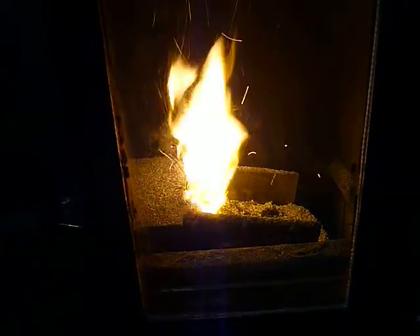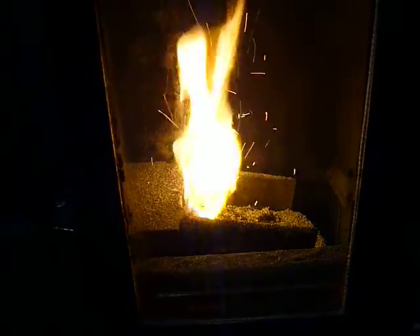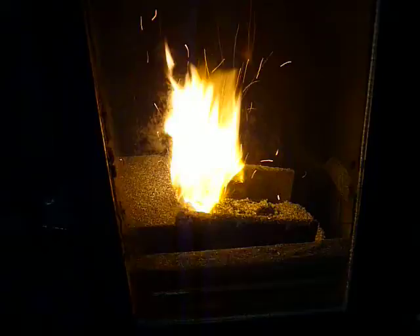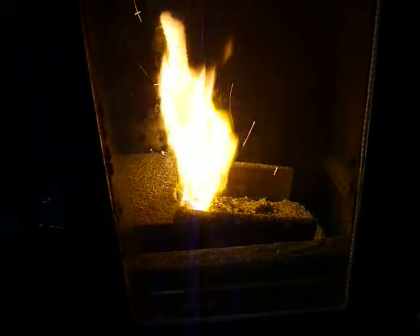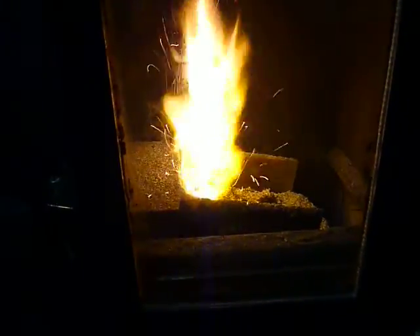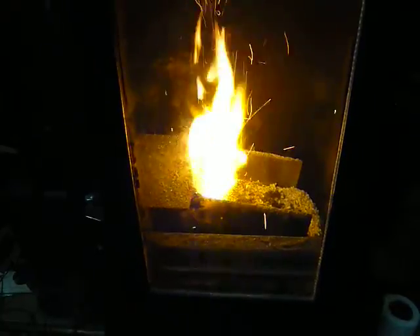The grate's made out of a cast iron barbecue plate that I cut up, fitted inside a 6 inch box section. The sides are bulged in, the bottom is a tap-in fit and it's sealed with stove cement all around the edges, so the air can only get out through the holes in the grate.